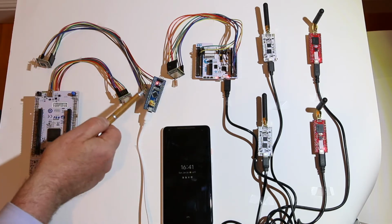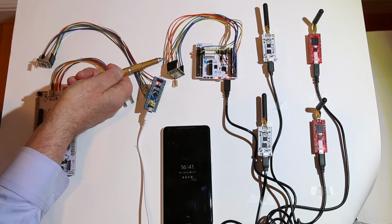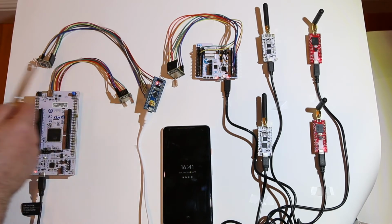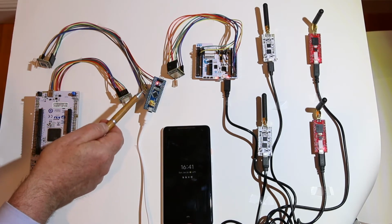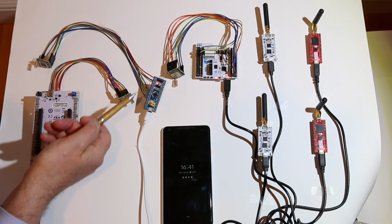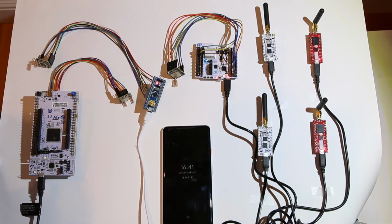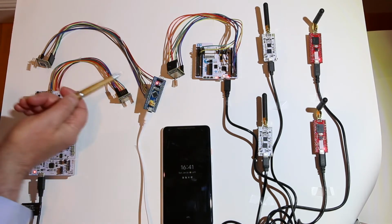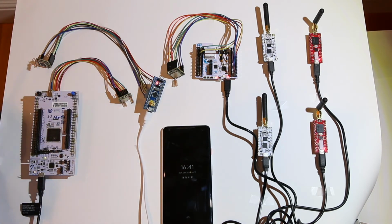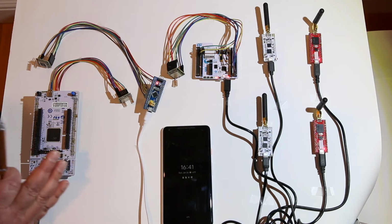And again, this one's connected to another LoRa radio, but this is a solution I rather like. It's a black box, like the server. Each of these guys has a black box radio connected to it. I think it's over an SPI bus, and you wire up the usual MISO, and the 2 interrupt signals, and it takes its 3-volt power, and there you go. You've got a LoRa radio. So this solution's quite good. It's basically only about $9, 6 plus the sub $2 blue pill board. So the most cost-effective LoRa radio solution I could think of right now.